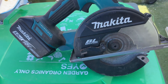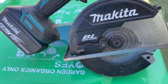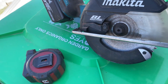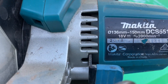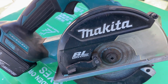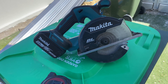Some guys use different tools — this is specifically a metal saw with an aluminium blade. I've had that blade for ages; they last a long time. If you use a regular circular saw with an aluminium blade it damages the blade because the speed is too fast, so this is specifically for cutting metal. It's a great little saw, pretty light, but extremely noisy, so make sure you wear earmuffs or earplugs. Now I'll cut these rails and get back up on the roof.